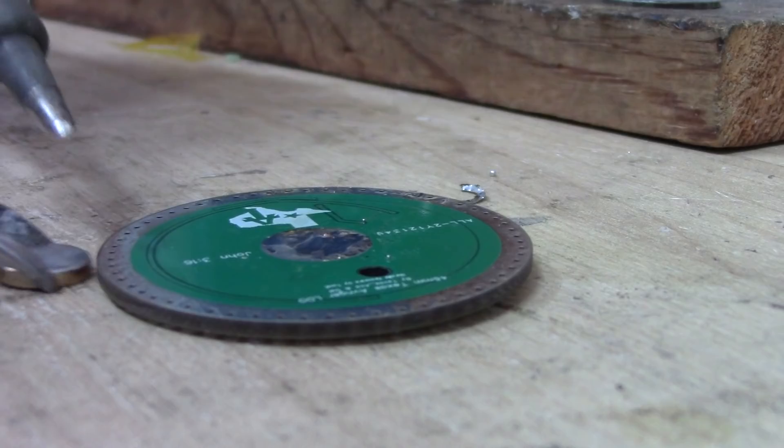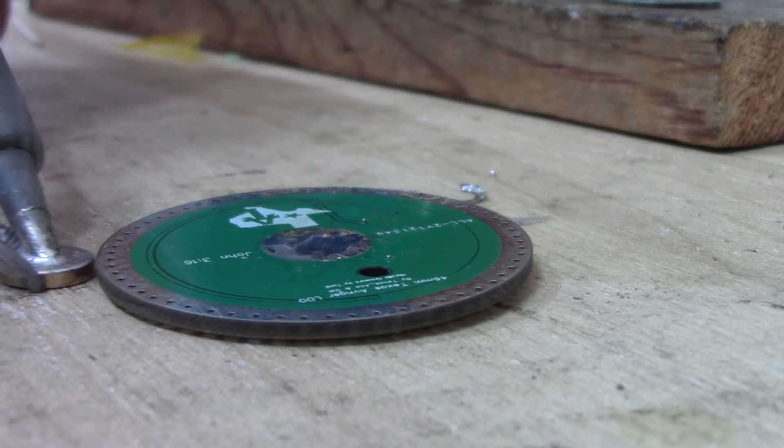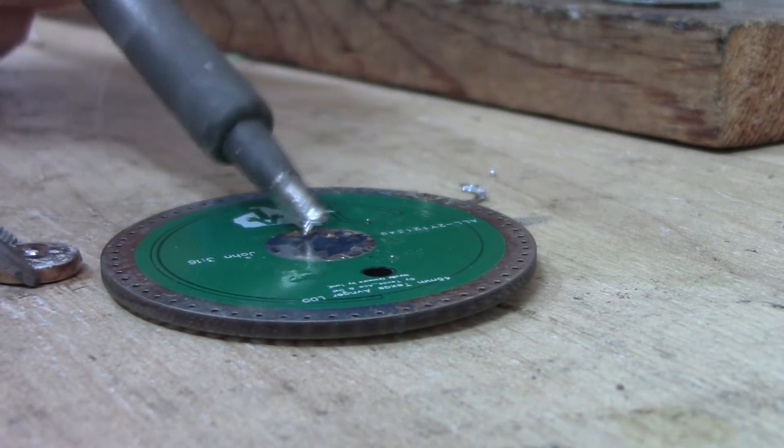Texas Ace created a MOSFET driver for this, so it'll be essentially direct drive — we'll get a lot higher current using this, so I'm going to try that out now. It came with a spring on it, but I'm going to replace that with a brass button.